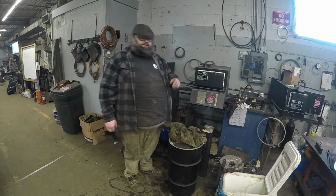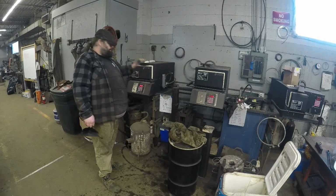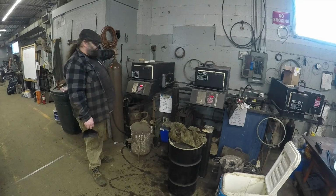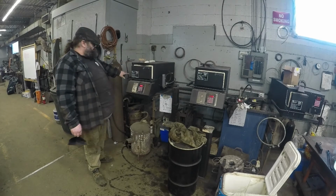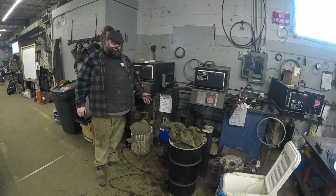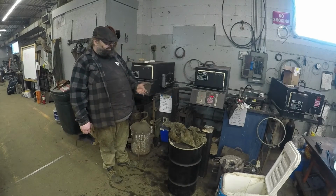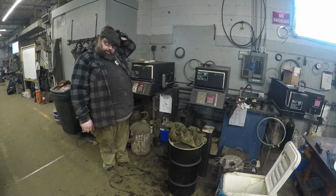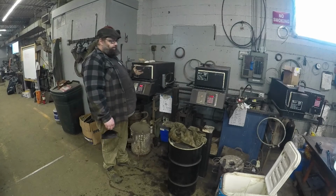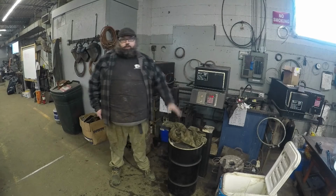So I bought some dry ice and set up a dry ice slurry before I set the kiln to run in a 3-step program. It's running up to 1100 degrees, at which point it turns the gas on. So it's an argon environment in there. And then it runs up to 1500 degrees, holds for 10 minutes to equalize everything. And then from there it goes up to 1950 degrees and holds for an hour. I took them out at about 30 minutes into the soak and quenched them in oil.